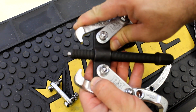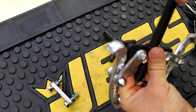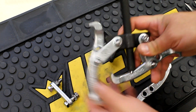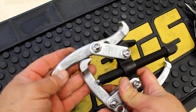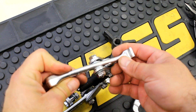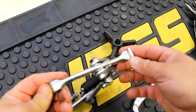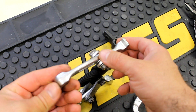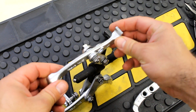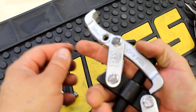With these pullers, you'll notice there's a wedge, and as it pulls on the gear it should lock in like this — as it's drawing the pulley out. I really like the satin finish. Can you see the forge marks on the seam? You can tell it's forged because the seam or that little ridge is not perfect — you can see they took it to the belt sander at the factory. A cast one would have a more uniform seam where the mold separates. The jaws are reversible and marked four inches or 100 millimeters.